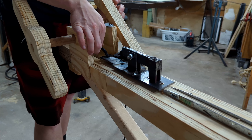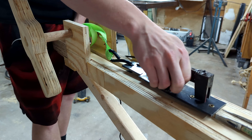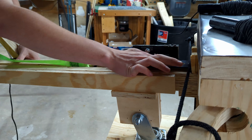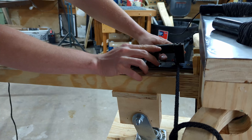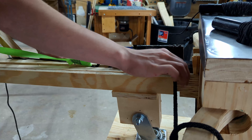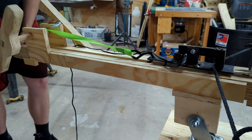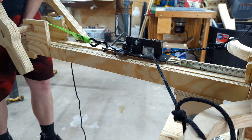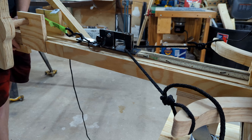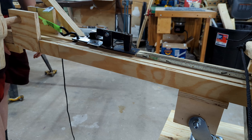This is attached to the slider. I've got to deactivate the winch and pull out some rope. When you do that, this whole part slides forward, all the way up to the drawstring. Put it underneath here, lock this in place — now the string can't come out. You reactivate the winch and then crank it. There's barely any force on those strings right now, so it's not looking very impressive, but it will be. When you want to loose the shot, you simply pull the string, releasing the drawstring.